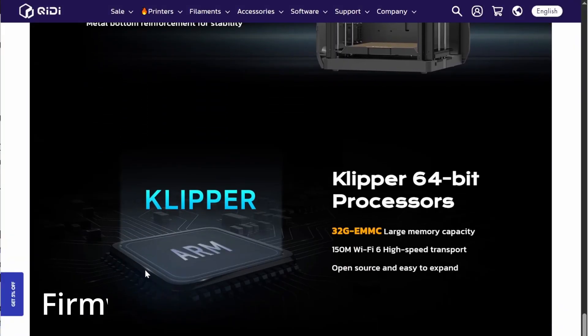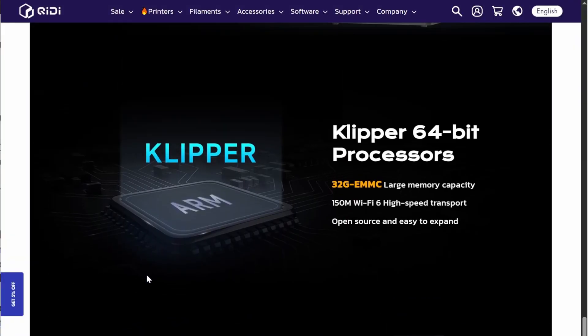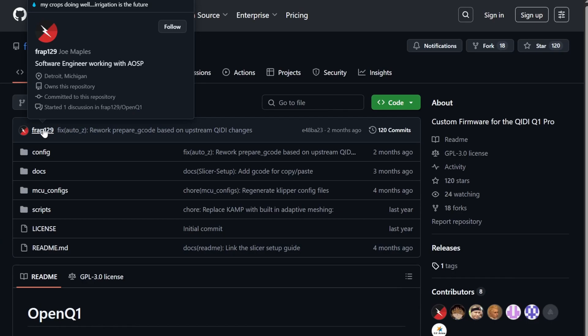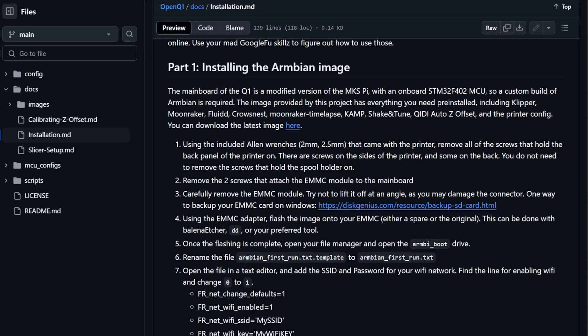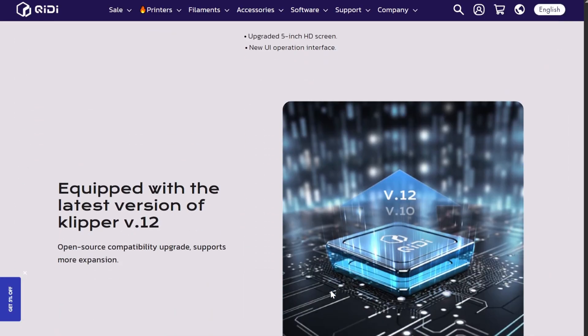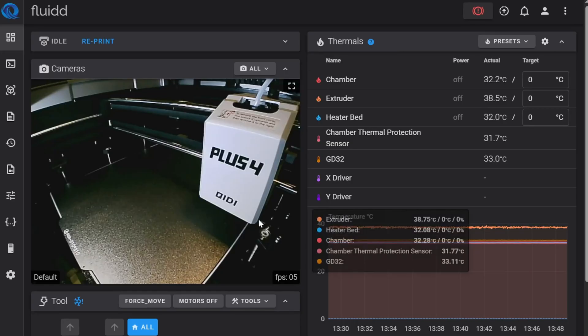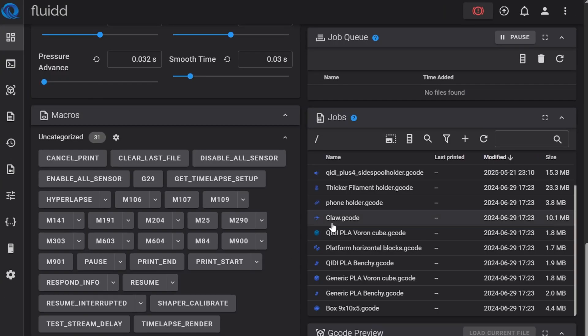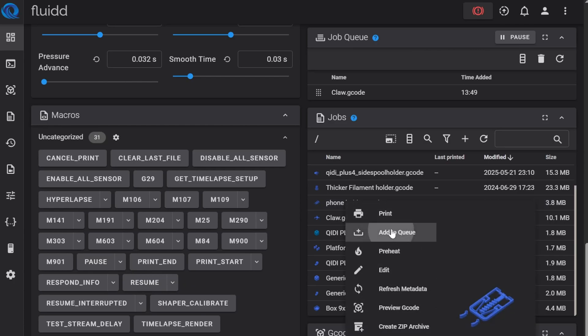Moving on to the firmware — another main reason I built my Q1 Pro print farm is because it uses open-source Klipper, Moonraker, and Fluidd UI software. Keep in mind that Qidi uses their own version that's not compatible with the latest updates of these packages. For the Q1 Pro, I had to install a version built by user Joe Maples, which allows you to update to the latest versions. I needed this because I use the Print Queue feature built into Moonraker and Fluidd, which allows you to automate your prints. This didn't work on the Q1 out of the box, and the installation took around one hour per printer. I'm happy that the Plus 4 has a more recent version of Klipper and Fluidd with this working out of the box, but this version still doesn't allow you to update these software packages directly — for my needs though, it's fine.